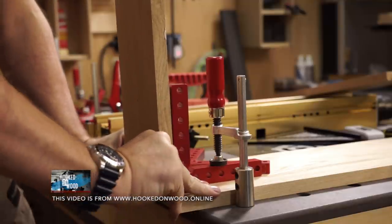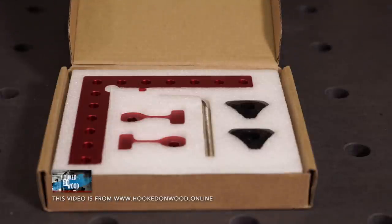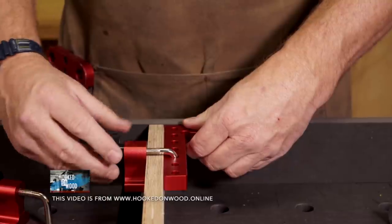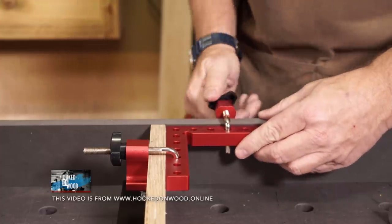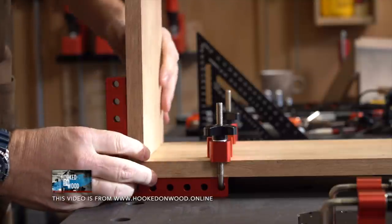When Banggood asked me if I would test these, I had my doubts in the beginning. The price is around $23, and I did not think they would be interesting enough because of that. But when they arrived, I immediately saw why they are more expensive. The fit and finish is very nice, and they are just of a higher quality. They also come delivered with two of these small clamps. The packaging is very good and underscores the quality. I asked for the 120mm version, and I see it as a benefit that they are a bit larger. The clamping mechanism is very simple but effective, and I still like to use these clamps. When you want to adjust two pieces, these clamps give you the most control and are easy to use. The biggest advantage of a combination of square and clamps is that you can attach this clamp in the square middle with these holes, making it very easy to clamp two pieces of wood together when making a cabinet, for example — which would not be possible this way with other clamps.